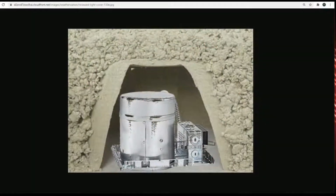So if you put that cover over that light, that'll really, really help in a lot of ways. Now, also that cover in the attic over the light is going to help if you're going to re-insulate. You want to make sure that your insulator, and most of them are really good about this, puts a cover over that can. If you don't, it won't be able to control the heat of that light fixture, and that light fixture will start cutting on and off because it has a little thermal coupling in it that tells it when it's too hot, and when it gets too hot, it turns off so it doesn't start a fire.